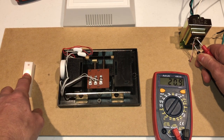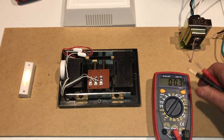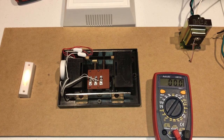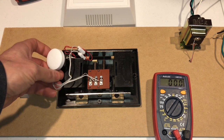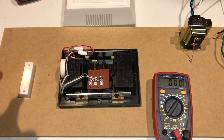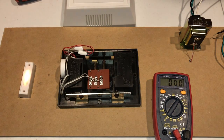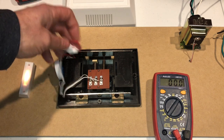Let's test it out. You saw that it dropped down to 16, then it went down to 13, and that was only a fraction of a second. So that shows you that this really doesn't last very long when the button's pressed. Hopefully it's long enough if you're going to keep your transformer. Otherwise I still recommend bypassing the chime.